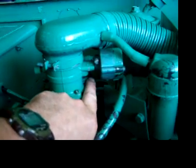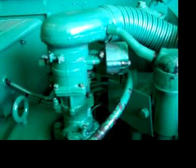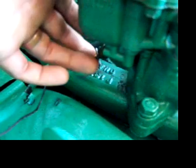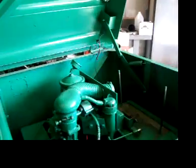On the carburetor, under your electric choke, is your idle mixture screw. The starting setting for that is a turn and a half out, and that's about where I left this one. Your high speed or main mixture screw is down here. One turn out is what the manual says is a good starting position. I found that a turn and a quarter is where this generator wanted to run to get good response out of the carburetor.